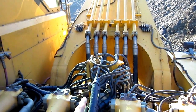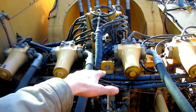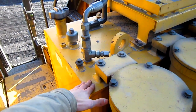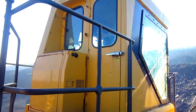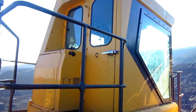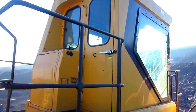This machine also has two swing motors, mounted on each end of the ring, which is a very well-engineered design. That way it will wear the ring more evenly and provide better contact area for the swing. This right here is the hydraulic oil tank — it holds 343.5 gallons of oil. There you can get a good view of the operator's cab, which is very large and oversized. When Komatsu designed the PC-2000, they increased the operator's cab size by 30% compared to the older PC-1800.